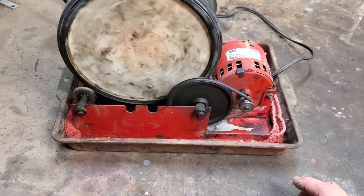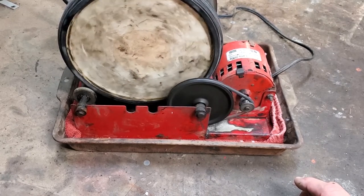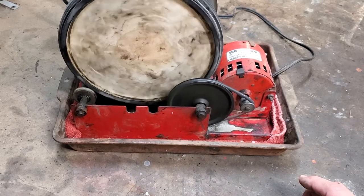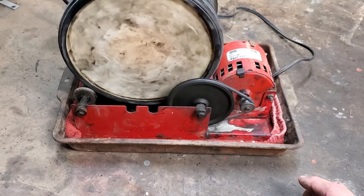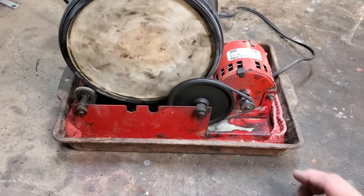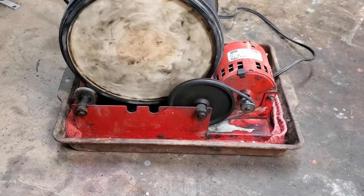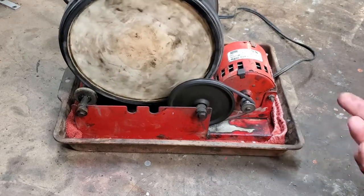Usually run it 24 to 72 hours for parts. At 24 hours I'll usually open it up and they may well be done. If they're super greasy, I'm probably going to change out the water and add fresh Dawn dish soap at that point. If you're just dealing with rust, the really rusty parts are sometimes the ones that take a little longer, because this is going to take all the rust off given enough time, provided you have enough variance in your media. We're going to let this run 24 hours and then come back to show you the results.